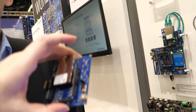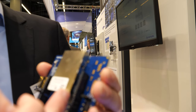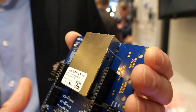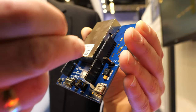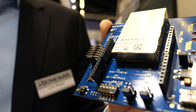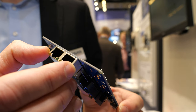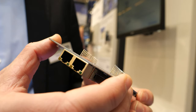So what is this board? This shows the module, and the module is sold on a solution kit board which provides different interfaces. We have a USB interface to power the whole board, as well as an Arduino interface, an Arduino shield, and a PMOD interface. On the back you have the Ethernet ports — 100 megabits, standard Ethernet for industrial communication, with two ports to establish redundant communication.